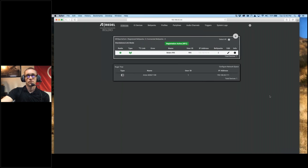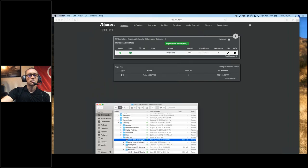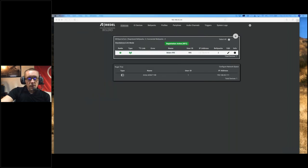Another question. Next one was, why is the total amount of uses per antenna 10? That, my friends, is simple. When you are dealing with DECT, there are 24 individual time slots inside of one DECT band, one center carrier frequency. There's 24. Well, wait a minute, why 24?